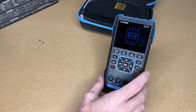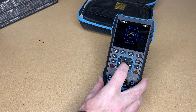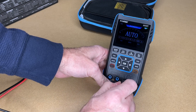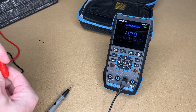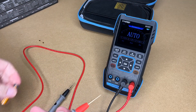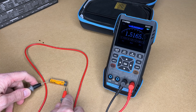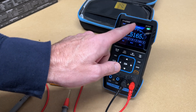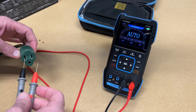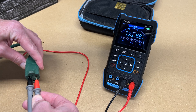I have this charged up and turned on. First I'm going to look at the multimeter mode. I'll go over to multimeter — it has an automatic mode. I'm going to plug the black lead into the COM and the red into the input on the right. I have a battery — I'll put the leads on it. It says 1.5165 volts, and it also has a little analog-style meter. Of course this will also measure AC. I have an extension cord — if you don't know how to properly do this, you should learn that first. It's detecting it as AC and we have 121.49 volts.